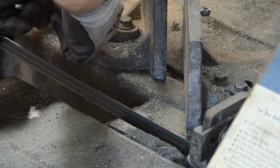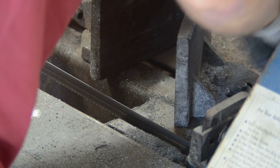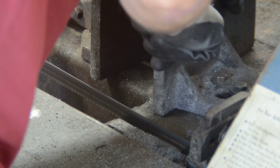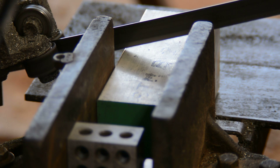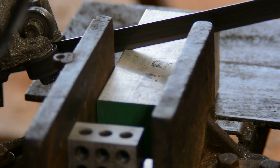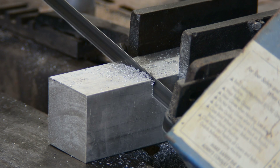The fixture we are making is very close to the raw material size you see here. You can cut the raw material down any way that's convenient for you. The important detail is to choose a raw material that is as close to your final desired shape as possible — this prevents excess machine time. When you make your cut, be sure to leave a little extra material.